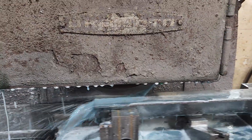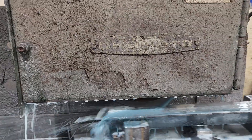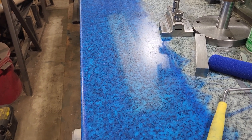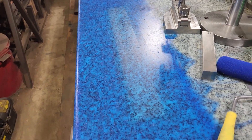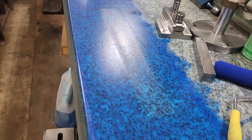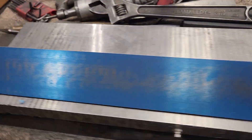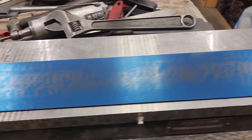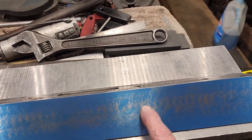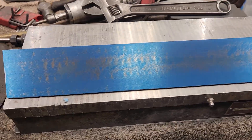When I get this done, I will print it and show you the results of that. So here it is after it was printed — you can see where I just printed it on that table. Most of the time you can see the witness mark of where you print it. So it's pretty flat — it's within a tenth. It's got light spots right here in the middle. That's it. So that'll scrape in real nice.